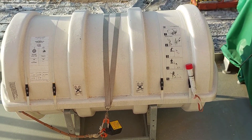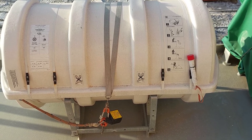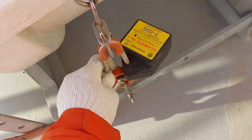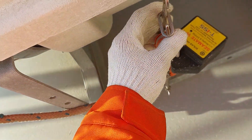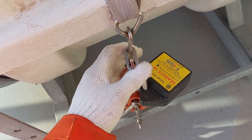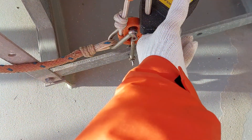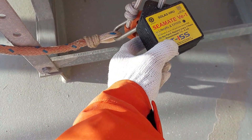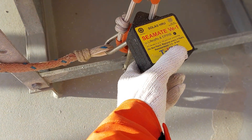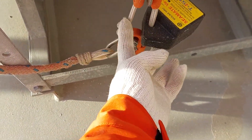As you can see, this is equipped with an HRU — meaning Hydrostatic Release Unit. There is what we call a weakest link. This is the weakest link of the HRU. This is what we call the slip hook, which can be removed manually if the vessel does not directly sink. The painter is attached to the weakest link, because this HRU will cut the weakest link — as per the manufacturer — at one to one-and-a-half to four meters depth, it immediately cuts this weakest link.